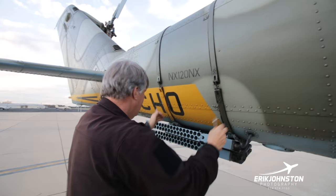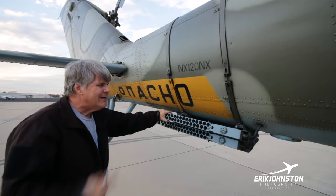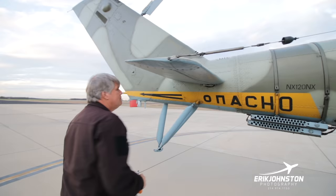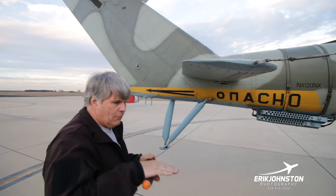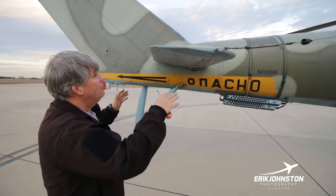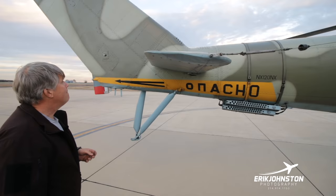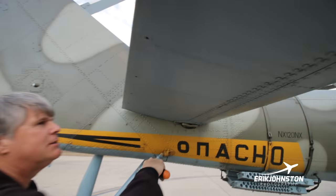Anything, as you know, in helicopters, anything when you get near the tail of the aircraft, the last thing you want, especially in flight, is things coming off and going through the tail rotor. That's just not good. Make sure that our elevator's in good shape. These elevators actually move. They move with the collective, so that whenever we're pulling collective, this is going to move in a way such that it lifts the tail up. It helps the tail fly up higher so that we can exchange some vertical lift for some thrust. So just make sure this is good. This is covered with some sort of a material here, and fabric, thank you.